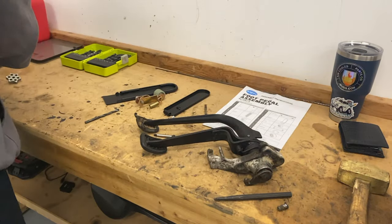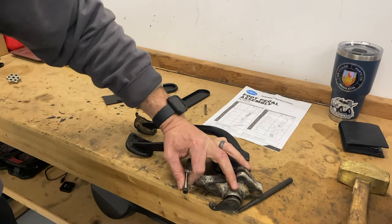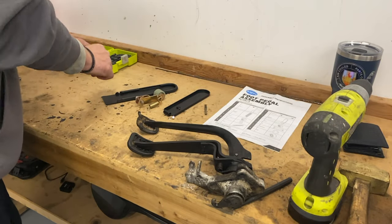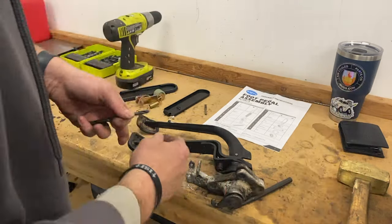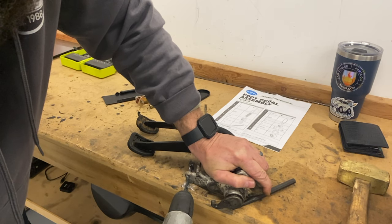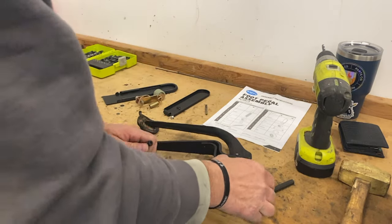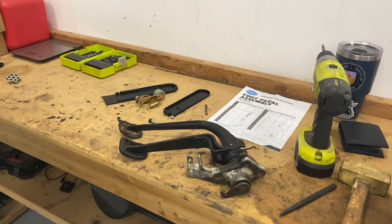That's why this roller had to be wide. And if it gets bent out of shape or this plastic roller gets worn out, everything starts to get very clunky — not going to be a problem anymore. We've got to drill this out with a quarter-inch drill bit. It measures 0.26, so the next size up is 17/64ths. We'll use 17/64ths as our next size. A 6.5mm drill bit would be better, but 17/64ths will do.